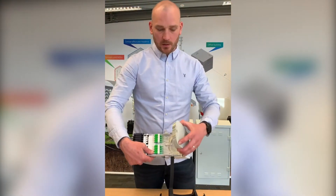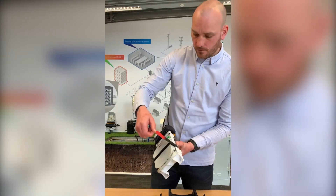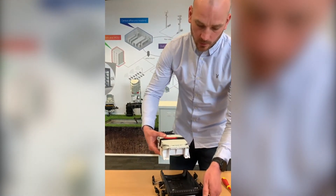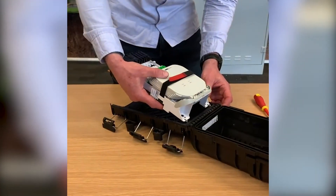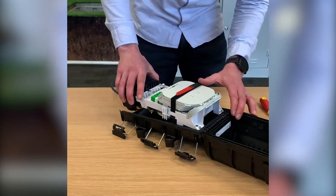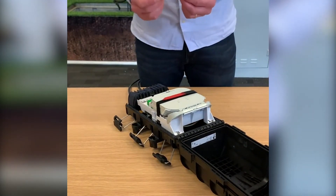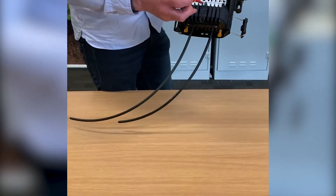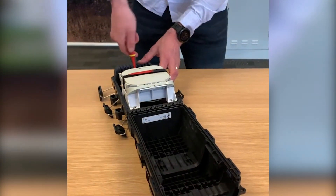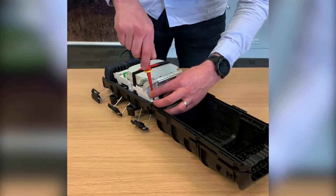Install the tray back into the closure, close the splice trays down, tie up the velcro strip, locate the slots at the top of the tray here and here, and then at a 45 degree angle position them into the closure into the self-tappers that you installed earlier. Then push into the door. With a Phillips screwdriver, locate the bottom screw and tighten the tray to the closure. Then gently tighten the self-tappers, but not too much.